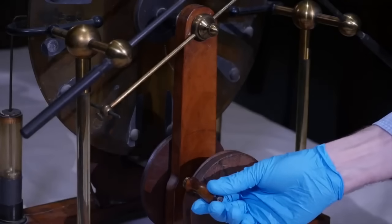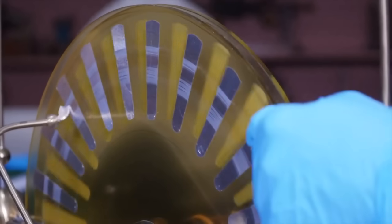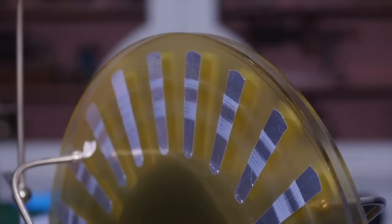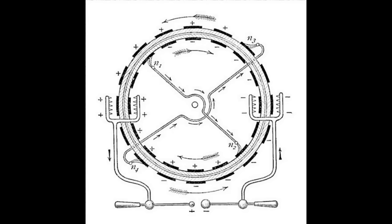It works because when you turn the handle, a couple of large glass plates connected to the handle by a system of pulley wheels and leather belts force the discs to rotate in opposite directions. The glass plates have metal foil sectors on them spaced at regular intervals, giving them the appearance of spoked wheels. It only requires a small amount of charge on any one of those sectors to start the process off. As they pass a neighbouring sector on the adjacent plate, they induce an equal and opposite charge, and this in combination with the action of two sets of wire brushes set at right angles to each other and touching the metal sectors has the effect of separating positive from negative charge and multiplying it.